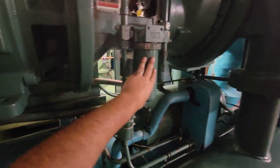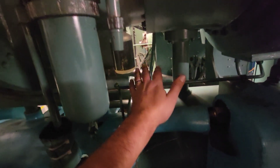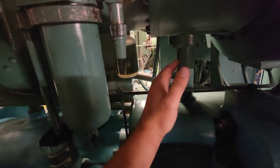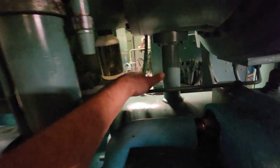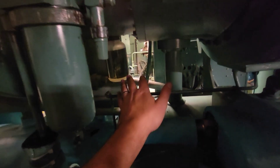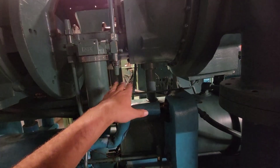While he's getting stuff out of the truck, we'll change the oil filter and there's a dryer down there that will also be changed in this process. This is the catch bottle. I don't remember the exact parameters — drop it in the comments — but I believe it's something like 750 milliliters over a month or six-month time frame. These shaft seals do have some bleed-by; that's completely normal. You'll gradually see it add up in the catch bottle over time. When you're constantly filling that bottle several times within a few months or a year, it's time to do something.